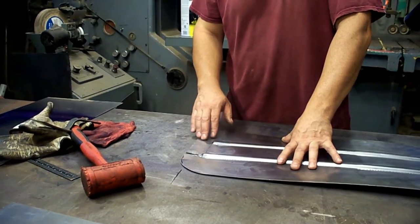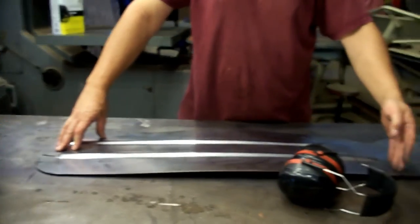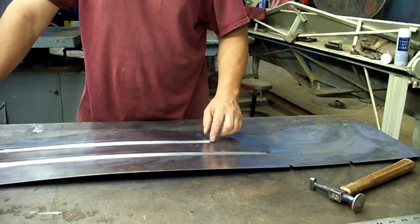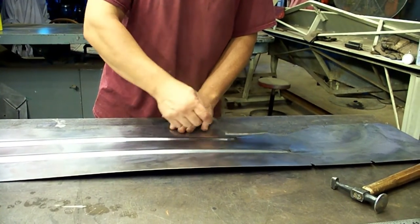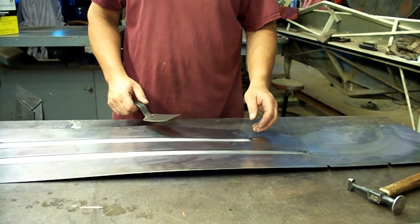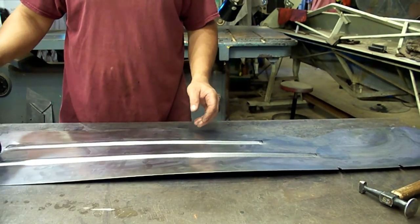Just a little bit on the kick shrinker — flattened that right out again. That's something we can work with now. We still got to round these off. Over here we're going to have a bend going through here, and that's going to help take some of that material over the edge. In here we'll work the edges down a little bit with this spoon in preparation for rounding that out. There's a lot of different ways you can round that out — some guys just do it with a hammer by hand, but I made a die for that. It makes it a lot easier and goes a lot faster. I'll get those in the Pullmax now and show you the rounding over the end.